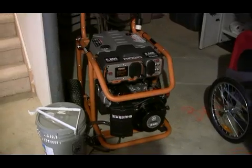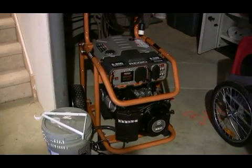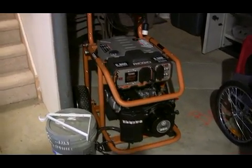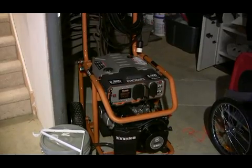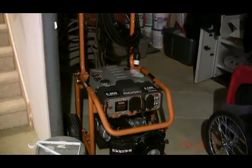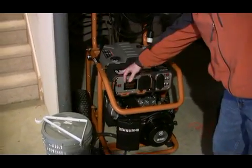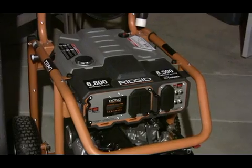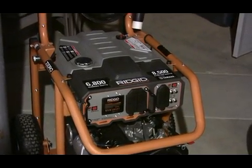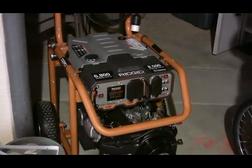So let me start with the generator. This is the particular generator that I opted for — I bought it at Home Depot. I thought it was a pretty good sized generator and I like the features that it had. It's portable, it's got rails on the back so that you can slide it up a step. It's about 7kW — they have 6800 running watts and 8500 starting watts. It runs for about 12 hours on the 8-gallon fuel tank, I think that's at 50% load.